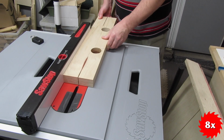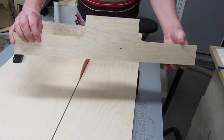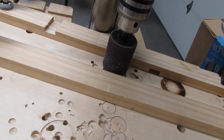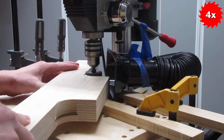I could have done all this with my bandsaw, but at the time I had just bought it, and I wasn't ready to tackle cutting wood this thick with it just yet. All in all, it worked pretty well, but as you can see, the rounded corners needed some cleaning up. So I set up my drill press to use a sanding drum to do the cleanup. I had already set the drill press to its highest speed settings, so I started sanding.